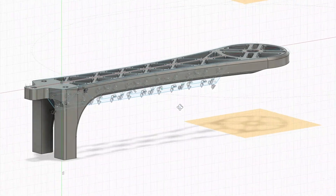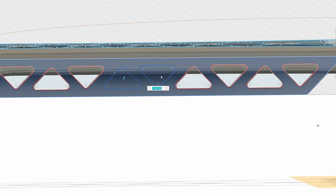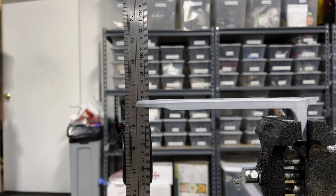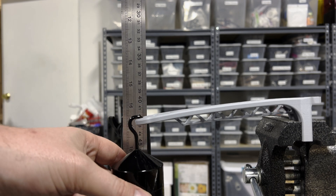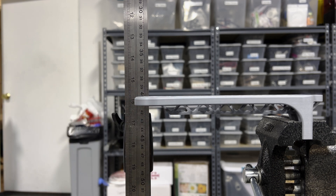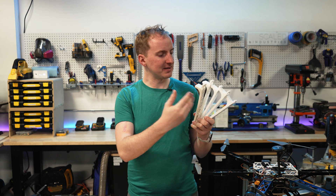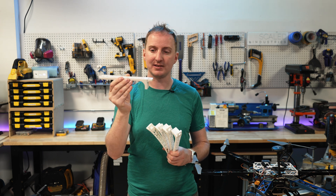With nylon being the pretty obvious filament choice in terms of strength and weight, I moved on to some design testing. 3D printers have one advantage over injection moulding: the complexity of designs they can do. My first attempt to make it thinner but add thick sides didn't really work well. I then moved on to adding a separate supporting lattice on the bottom, which worked well with a short length and even better extended to the full arm length. This PLA print only deflects 11mm — almost half of the base design. So the answer is yes: you can 3D print drone arms that are basically as strong as the original DJI injection-moulded ones.